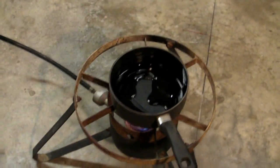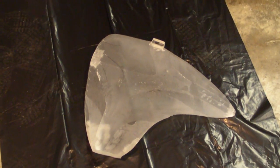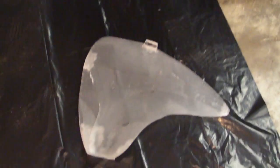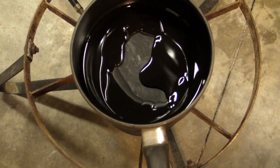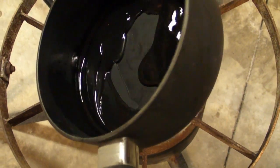We're going to try and thicken this puppy up by pouring some machinable wax onto it. And then we can actually scrape it down. That's what I've got — a plastic bag down there to catch the residue. We'll pour some on you? No, you're right, because machinable wax is not normal wax. When it gets on you, it sticks like nothing else and it is much hotter than normal wax. So we just wait for this to finish melting down.